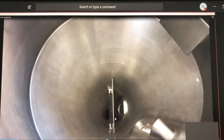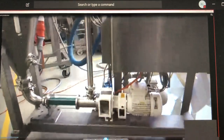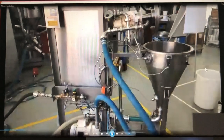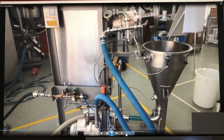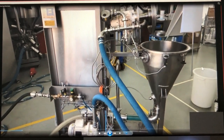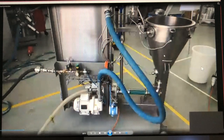Inside, on the bottom, we see a little vortex breaker, and here a side glass so we can see how the product flows down. That's our discharge pump — a mono pump. The blue pipe is the connection to the vacuum pump, which is a water-ring vacuum pump. Here you can see two level sensors, making it possible to run a continuous deaeration by setting a value — for example, around 50% filling.